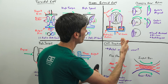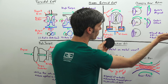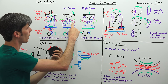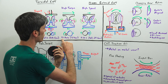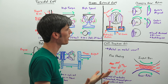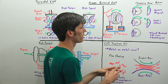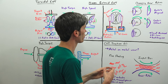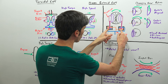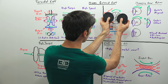If you do the opposite and move it up, the force acting on it goes the other direction — you'd have a horizontal force and a vertical force pushing it inward, giving you a higher torque, lower gear ratio application. The amount of movement actually required is very small — as little as a tenth of a millimeter to as much as a millimeter. That small movement is enough for a significant gear ratio change, giving very quick response. The hydraulic lines move in opposite directions so both rollers move in or out together.